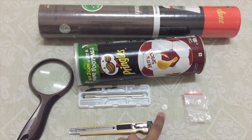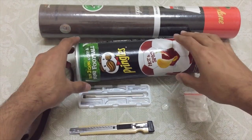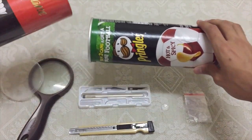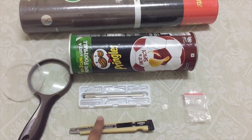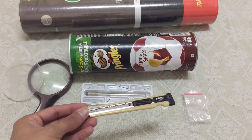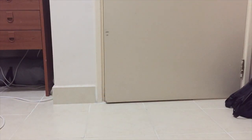I do not know the focal length of the objective lens, but I do know the focal length of the small eyepiece lens, which is 14 millimeters. We'll be using these containers because they fit snug into each other — you don't necessarily have to use these, but they work really well for focusing the image. You also need an exacto knife or a cutter for cutting.